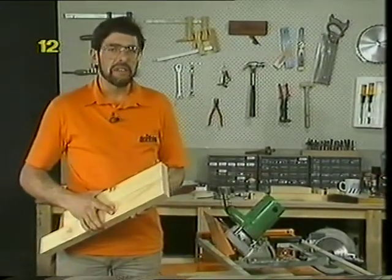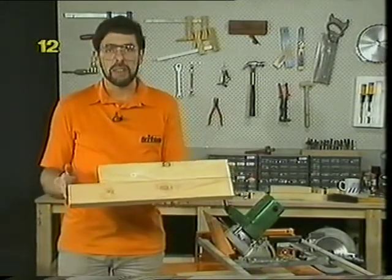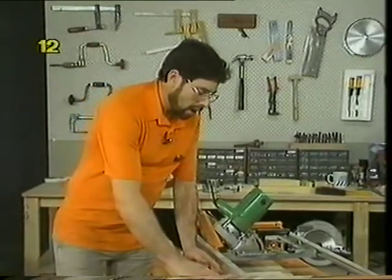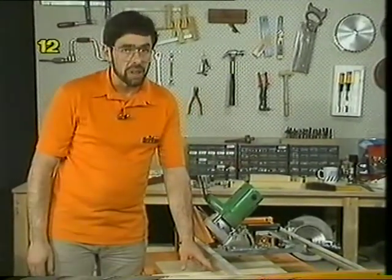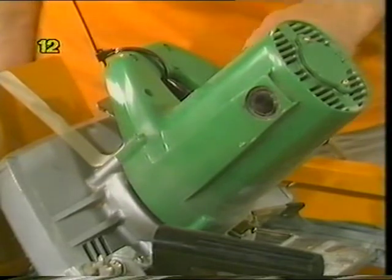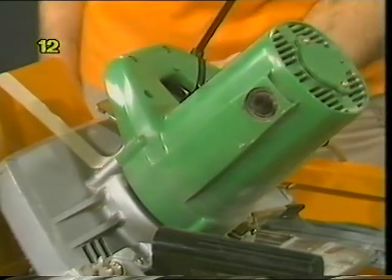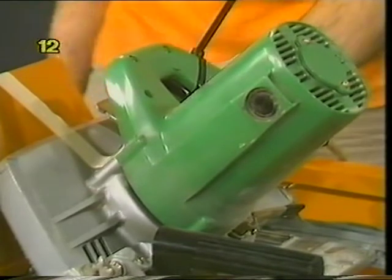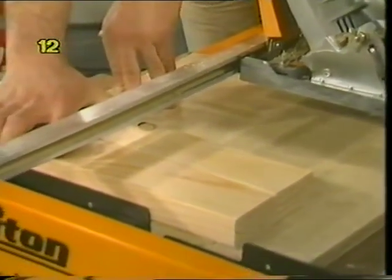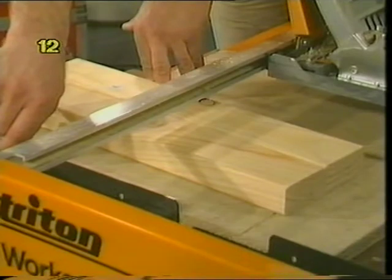The piece of particle board I just cut is very free-cutting material. Now get yourself something a little harder — softwood will still do — and get a couple of fairly lengthy pieces long enough to hold comfortably. A bevel cut puts an enormous amount of load on the power saw, so you must have a sharp blade and don't feed too quickly. Because of the incredible load on the saw, we strongly recommend the locked-on trigger technique. Also, there is a tendency for the wood to move, so hold it firmly or consider clamping it, or put a sandpaper face on the work stops to hold the wood more firmly.